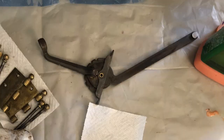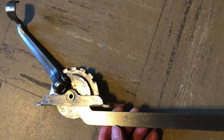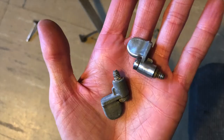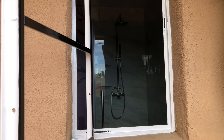Now let's look at the hardware. This is after I stripped the paint and cleaned everything with mineral spirits — still a little sad looking. I considered electroplating the parts, but decided to just polish up the steel with the polishing bits on my Dremel. Here's the crank mechanism all polished up, and the latch. Here's the difference between the original screen clips and the polished ones. I don't know if they're oxidized or zinc plated, but for now I'll just leave them raw and see how they do.